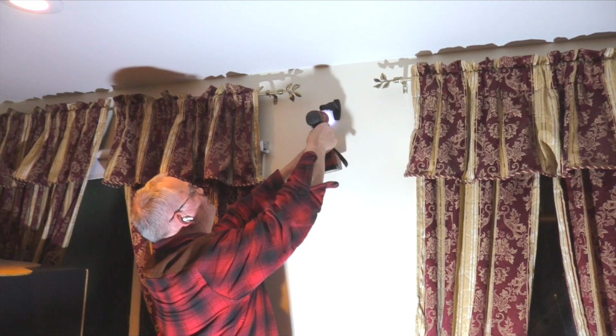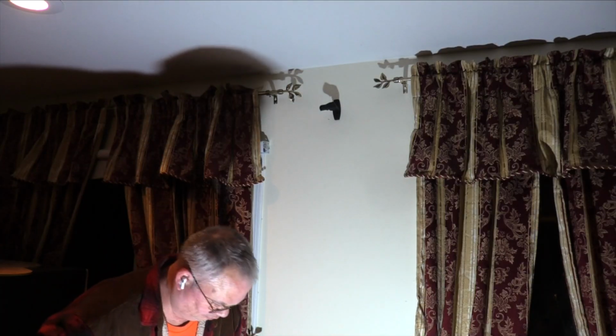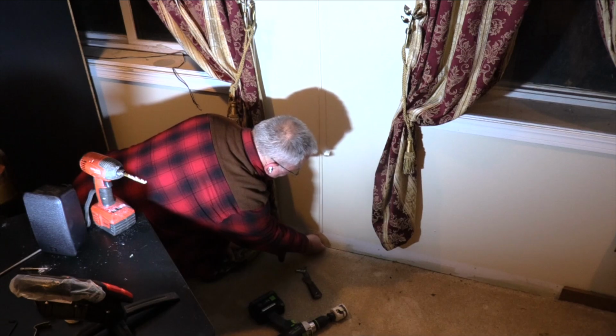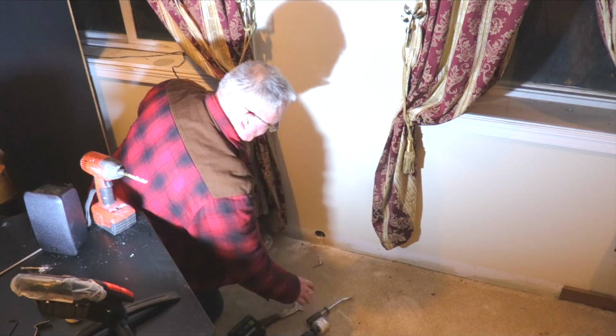With the left-hand side complete, I moved on to the right-hand rear surround. And I went back to drilling a pilot hole prior to the main hole. Even an empty string was enough to align the output hole. I attached the string to the speaker mount bracket using a slip knot to prevent it from being prematurely drawn through the wall. I was easily able to retrieve the weighted string from the hollow wall.